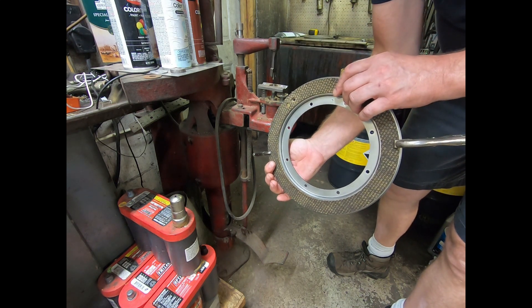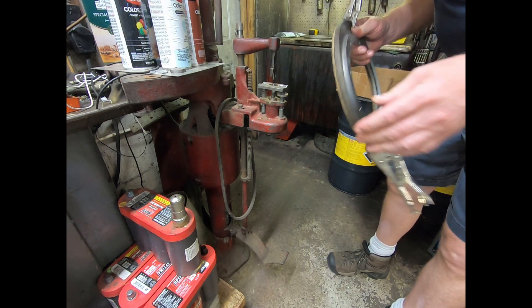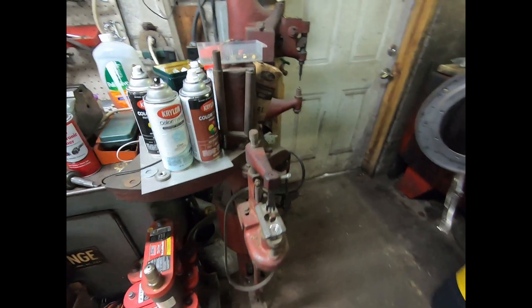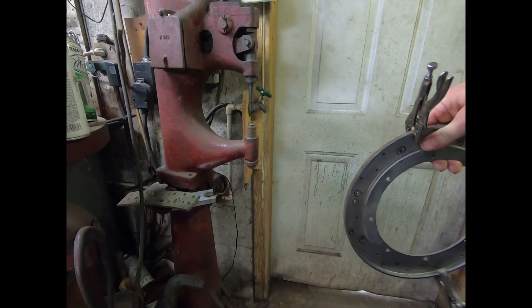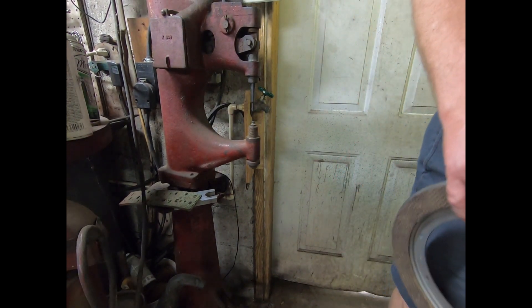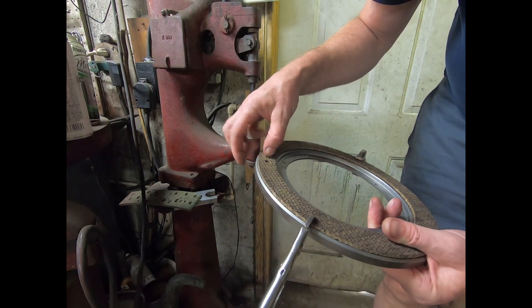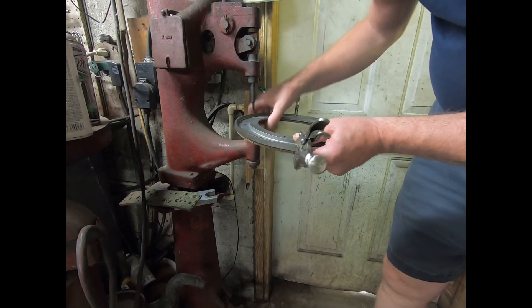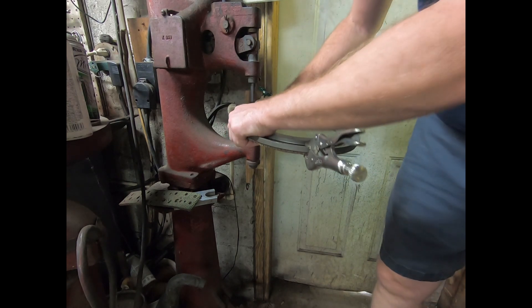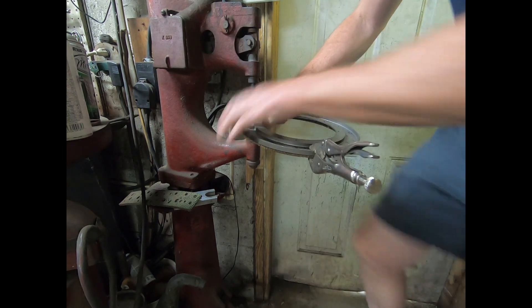Then you check and make sure that everything went through okay. Once you do that step, you go right to the rivet end of it. Put your rivet in the drill counter-bore hole, make sure it's in there very good and far. Use the bottom mandrel to make sure you've got the head good and deep into the counter-bore, and then step and set the rivet.